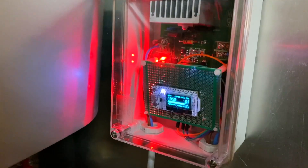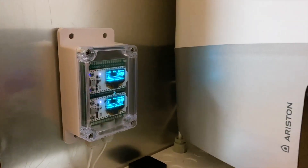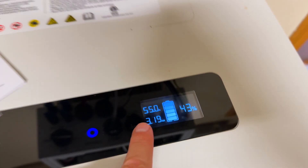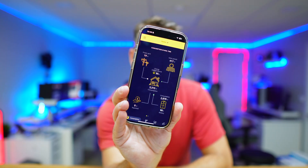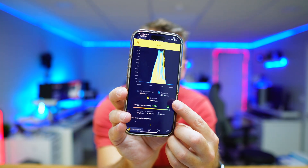If you remember the excess energy manager product we shared a few years ago, it works exactly the same way but in a bigger way. The D6K detects the surplus energy and sends it to my 15 kilowatt-hour battery that I shared on my last video, and there's almost no energy wasted. Last few days I sold about three or four kilowatts. I sell at $0.05 per kilowatt-hour and purchase at $0.18 per kilowatt-hour, so it's a huge difference.